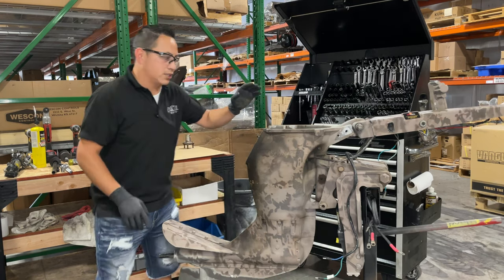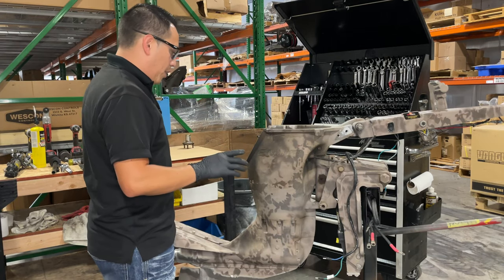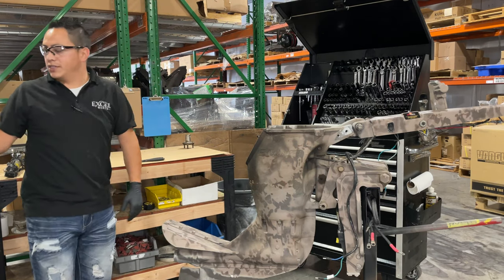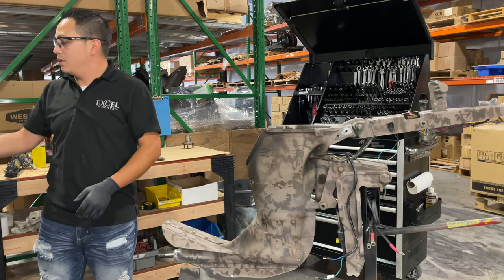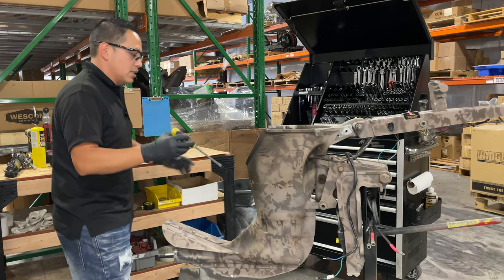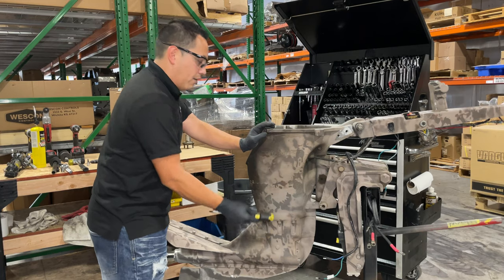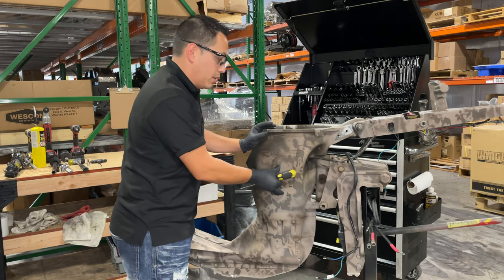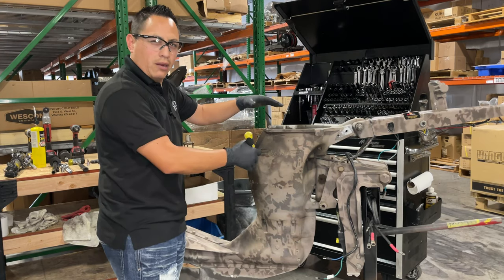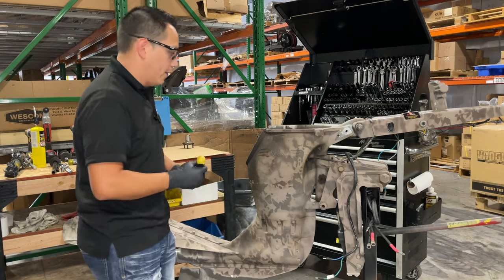The only thing I did was pull the power head off, because we're gonna send that thing to work with Micah. But I'm gonna start with this. The very first thing I wanna do is drain the oil. Now, I'm doing this because we are going to check the drive, we're gonna check bearings, we're gonna check gears up here in the middle section, which is the transmission, and also the bearings. There's a few bearings up here, but mainly it's the drive shaft and whatnot.